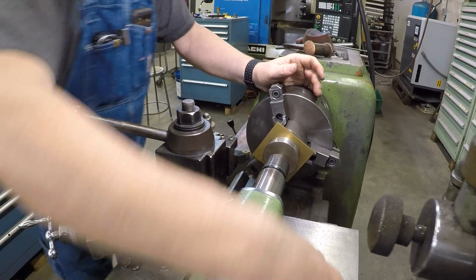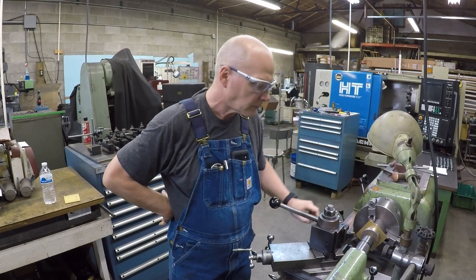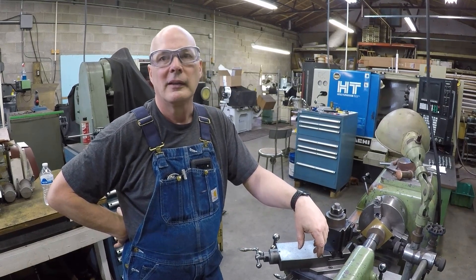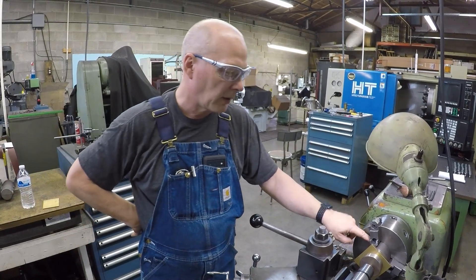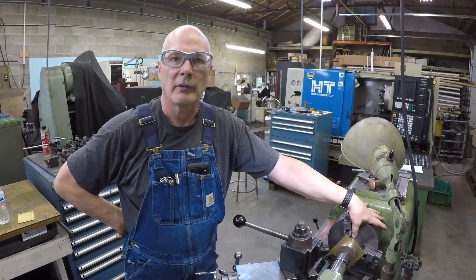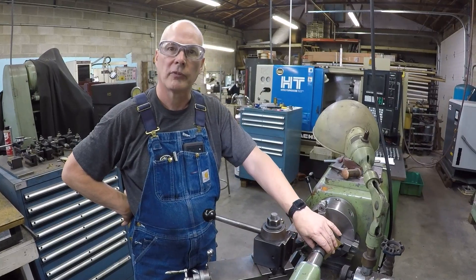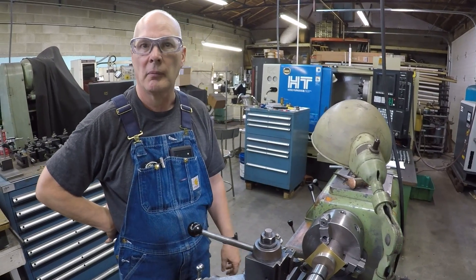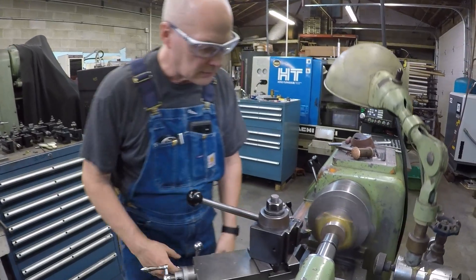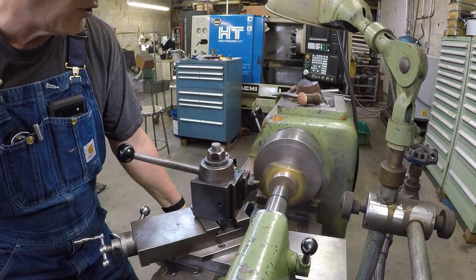You're using experience to feel the comfort of the tailstock. I have this backed against here so it can't back up. If you have it in a CNC machine, you'd want the same scenario. If you hold everything out on the first couple of teeth it's hard on the chuck — why strain the chuck when you don't have to? That way this can't move. You can put almost any amount of pressure, but back the pressure off some if you're worried about distortion. You don't want to take huge cuts when it's sticking out that far.